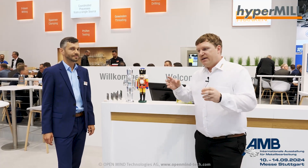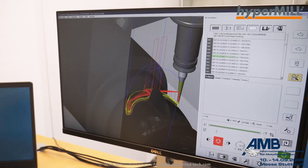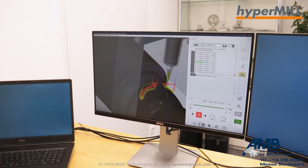The clamping length is also a good point because with the whole setup device and raw material we were reaching the limit of the machine's axes. Our application engineers had to program in an indexed manner and then align the table, which makes it difficult to select the right solution and create connection movements between operations. But with hypermill virtual machining and our optimizer technology it's really easy — we automatically look for the best solution and create linking movements between different operations, so engineers don't have to worry about machine kinematics or limitations and can concentrate on programming.